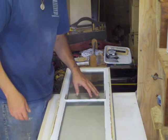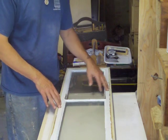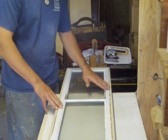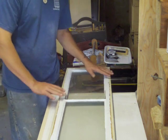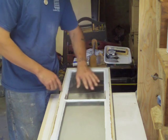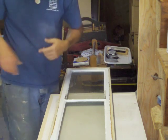What we're going to do today is remove a piece of glass from a side light that's going inside a doorway. I'm going to sand down this finish with 40 grit just to knock out some of the big chunks, eventually finish it with 80 to 100 grit, and remove the old caulking with the glass. The first step is safety — put on a dust mask for protection.